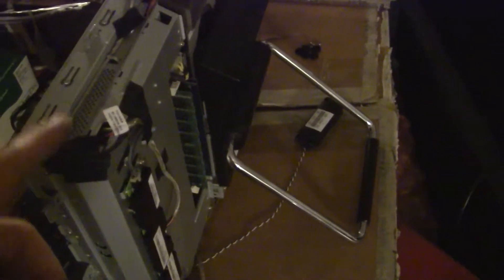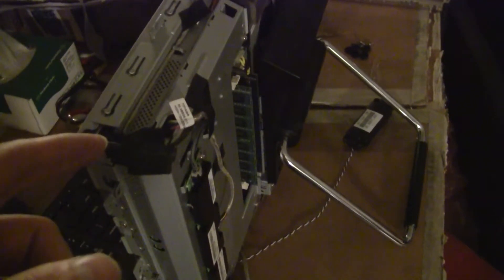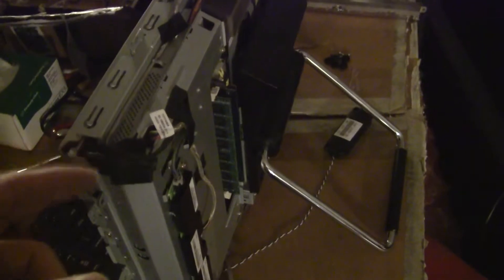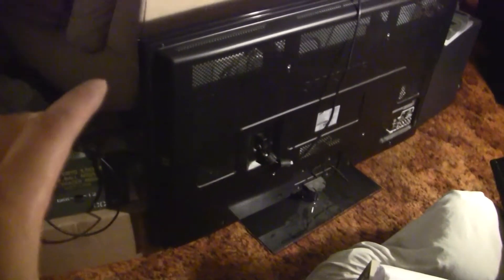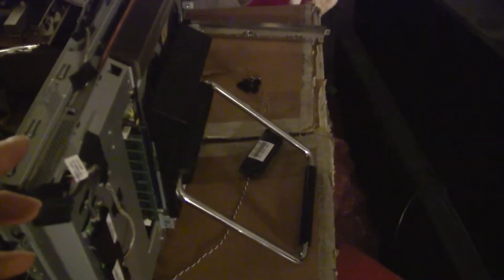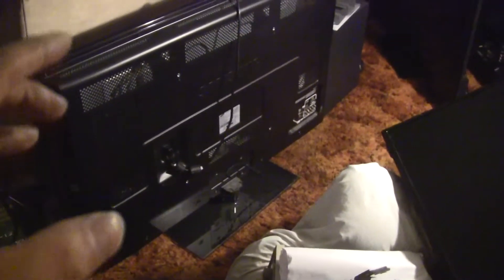I might have a new project where I'm going to try to hack in, modify this — first I have to see what the video capabilities are on board. But it might just be something where I transfer it over to a universal video adapter, some kind of video adapter card. It'd probably be helpful to have multiple outputs while I'm doing it, so I could output and basically still use a main board for whatever TV is going to go into the 51 inch case, then have the need for an additional video adapter board to adapt this motherboard to work on that larger 50 inch screen.